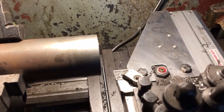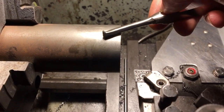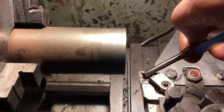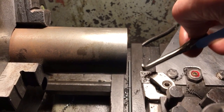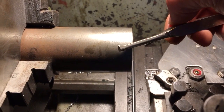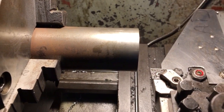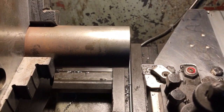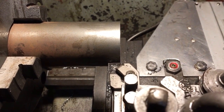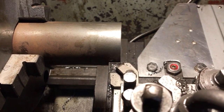As an example, we'll take this bit of two-inch bar and we want to go to inch and three quarters. So let's split it down into a 50 cut, 100 cut, and 100 cut — that's 250 thou, plus or minus 2 thou, we'll see how we go with the tungsten carbide tool. We'll come in, touch off, and take say a 100 thou cut. I've got 610 RPM on a two-inch bar — we'll see what kind of finish we get.